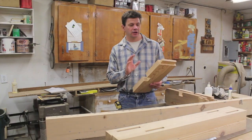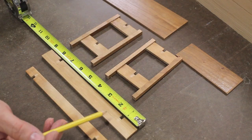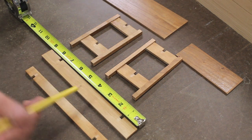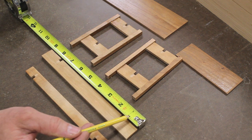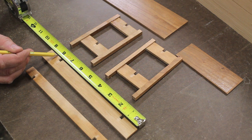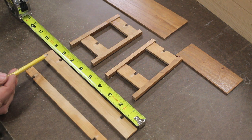I've put a notch in all of the cross pieces and the next step is to cut the beams to length. The top beam on the scale model measures eight and three-quarters of an inch. Since I built the scale model at an eighth-inch scale — meaning an eighth of an inch equals an inch — I'll multiply eight times eight which gives me 64. Then I count the remaining three-quarters in eighths: 64, 65, 66, 67, 68, 69, 70. So I need to cross-cut the top beam at 70 inches long.